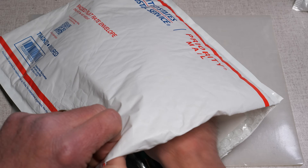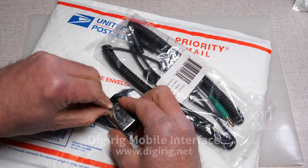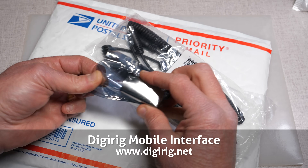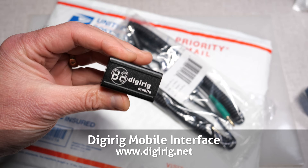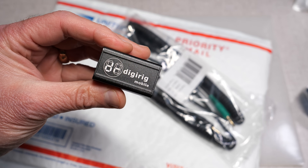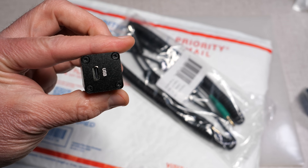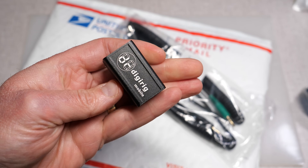At least we're going to test that today. I'll tell you a bit more about the DigiRig and how I set it up for my FT-891, then we're going to put this park on the air. The DigiRig Mobile is a digital modes interface that combines audio codec, serial CAT interface, and push-to-talk control. What really makes it different, other than its diminutive size, is the ability to communicate with the transceiver in one of three ways: CAT, VOX, or push-to-talk via serial RTS signaling. In most cases it only needs a single USB connection. Because it's built on an open-source platform, it's quite flexible and extensible.